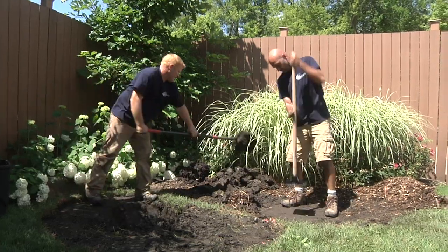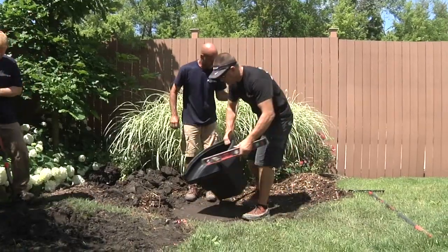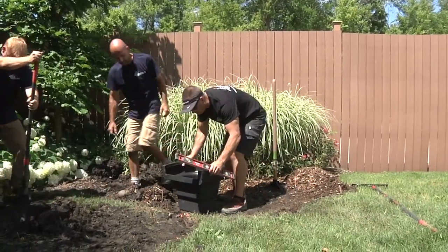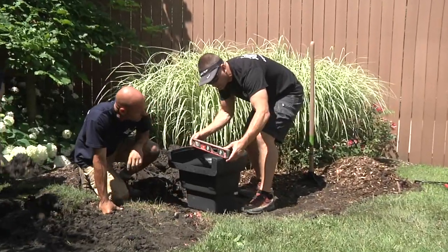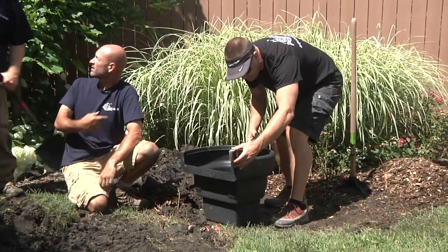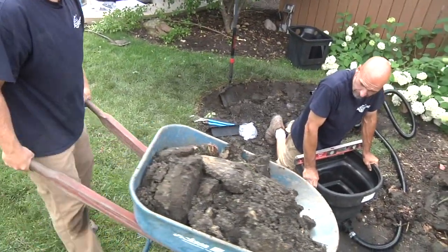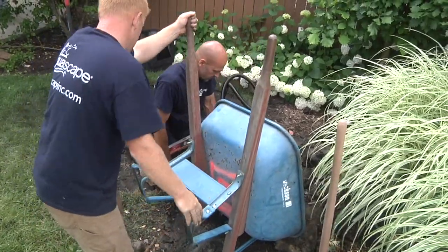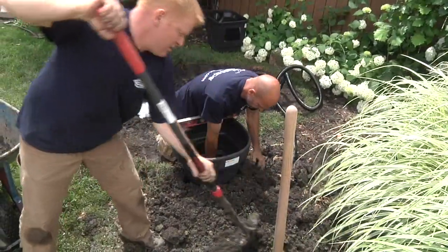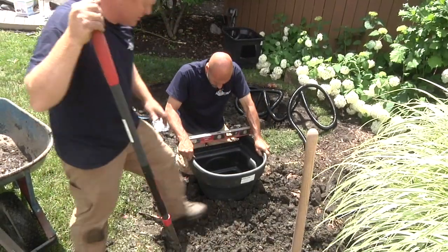Compact the soil with a tamper or heavy flat surface like a concrete block to avoid future settling, and then reposition the filter so that it sits level side to side and leaning slightly forward. It should be about a quarter of a bubble on the level. Once set, put weight on the filter and use dirt to backfill around the sides and back of the unit to help lock it in place. Burying the hose during excavation rather than after will save you the time and energy of digging up the berm to trench the pipe later.